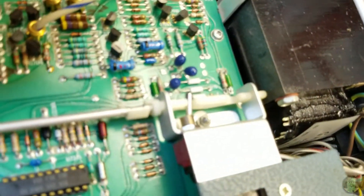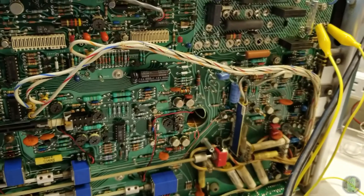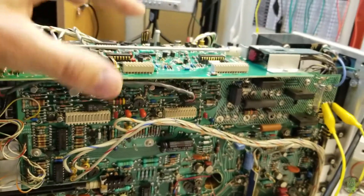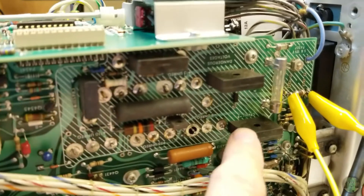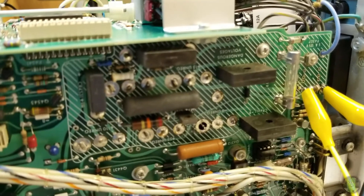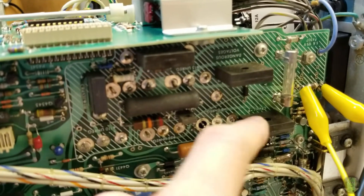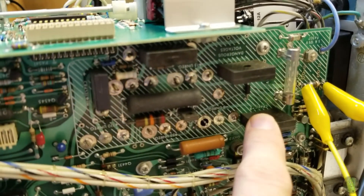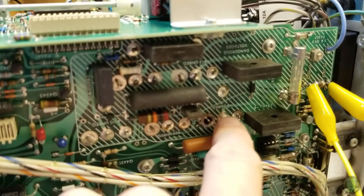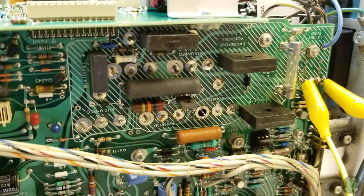All these wires are tied directly to the power connections on the back. I could pull this off, but the screw for the other side is on the other side, so it won't easily come off. This whole thing is very difficult to work on, and the service manual doesn't have useful information like 'to work on this board, remove this piece then that.' I've narrowed it down to what component could be bad, but I'm almost tempted to just cut it away destructively and solder a new one on the backside — but if I remove it and it's okay, I've destroyed it, and trying to desolder it risks pulling the pads off anyway.